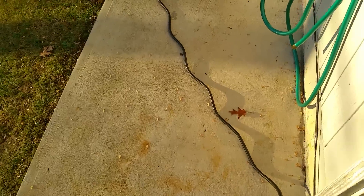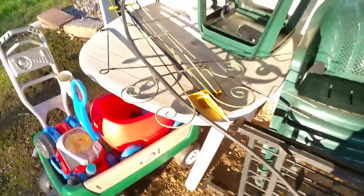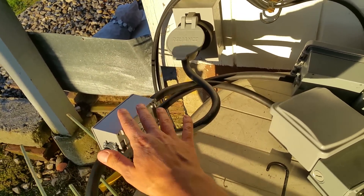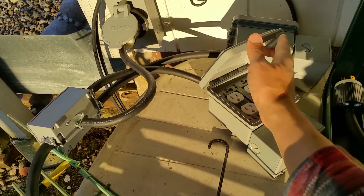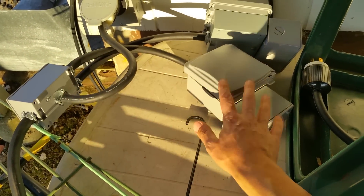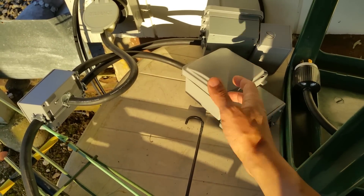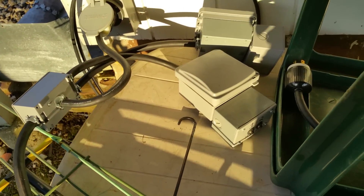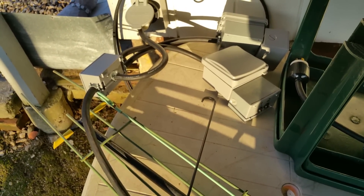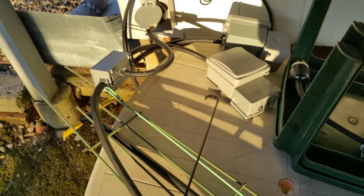Let me walk outside to show how I would normally connect this up. This wiring goes all the way over to the inlet box. I've taken a 10/4 wire and made a three-way splitter box with 15-amp circuits on each one with circuit breakers on each side — two 15-amp circuits on the X side and two 15-amp circuits on the Y side. When using the generator, you can balance the load so you don't overload the neutral. Since the Tiger Claw is only capable of about 13 amps continuous at 120 volts, you don't really have to worry about overloading the 10-gauge neutral wire.